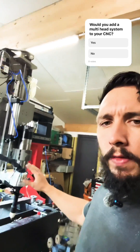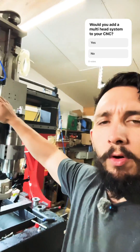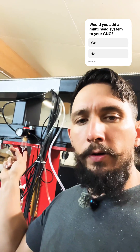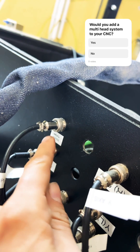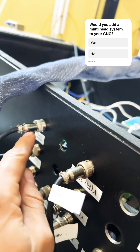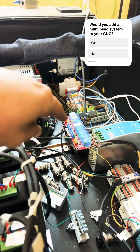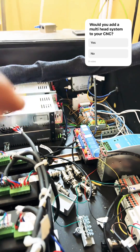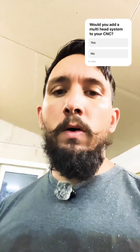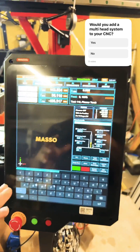So a quick update on what I did: I installed the breakaway torch to a pneumatic cylinder, connected the hoses to the solenoid, ran the hose back over to a pressure regulator, connected a GX16 aviation connector to the relay board. We're literally ready to go — cooking right now with the CNC machine. Let me show you the Masso display real quick.